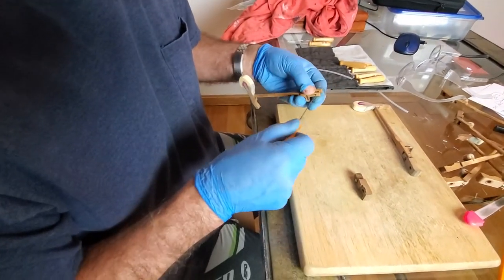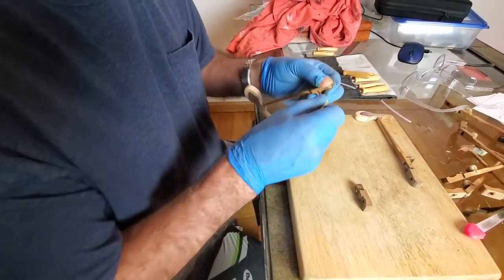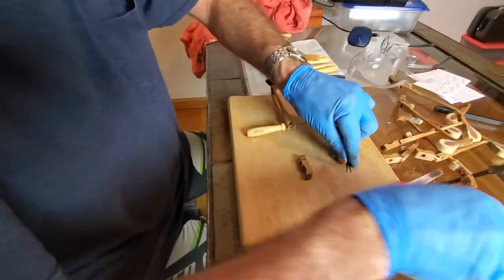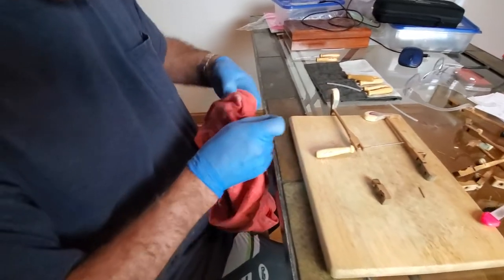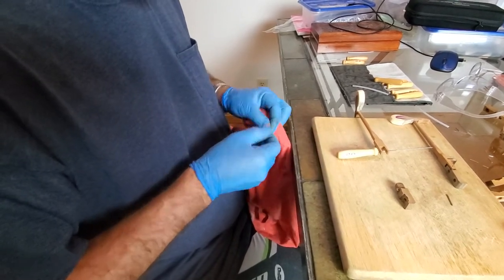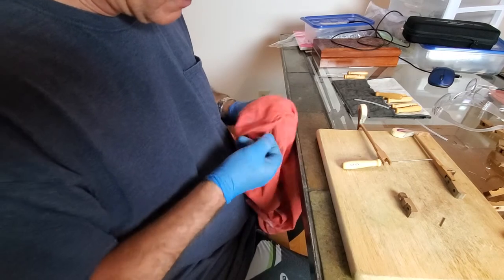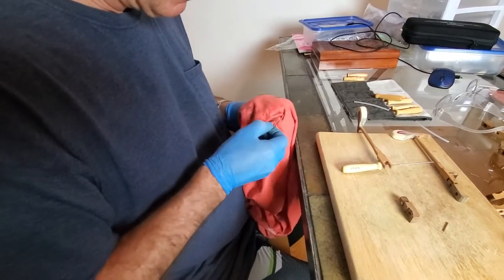I do it graduated. Those are two pins, and they need to be polished, because if they're smooth they work better. We come here because these turn in the felt, so it's very important that they're smooth. We just clean them up a little bit. Sometimes they're messed up, sometimes not too bad — these ones are not too bad.